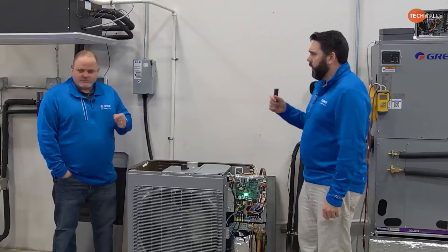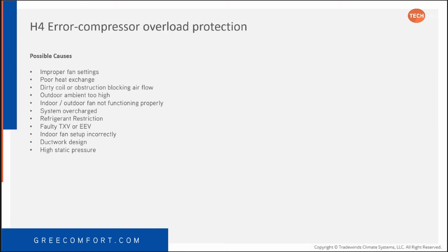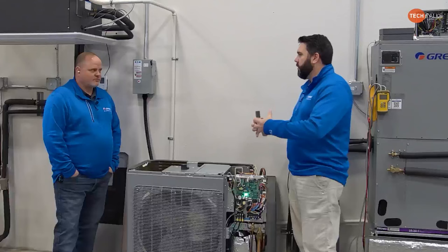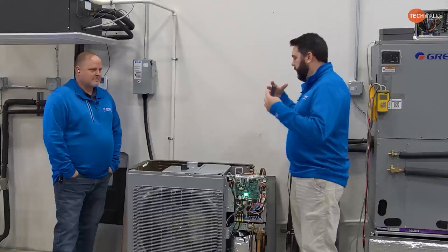So where were we? H4 air compressor overload protection. I think we covered that pretty good already. H5, H7, HC, LC, startup, PO protection. So I don't want to answer that right now. You want to get the camera over here? No, I want to talk about that when we talk about inverter design and setup, because that all pertains to that. Okay. And that's the next segment we got coming up, which will give you a better understanding of why you get H5 codes, why you get H7 codes, and those codes alike. And the reason why a lot of the training kind of meshes together is that the Flex, the Mini Split, the Multi Pro, it's using an inverter board, it's using an inverter compressor, so it all kind of meshes together with what we're talking about.